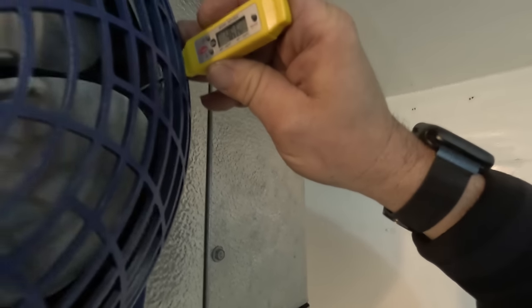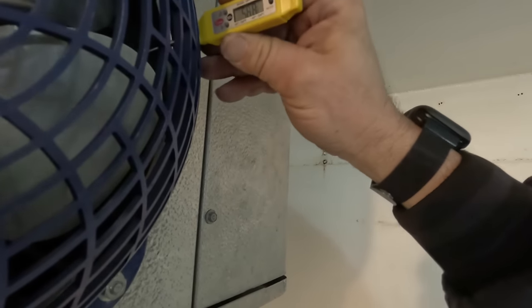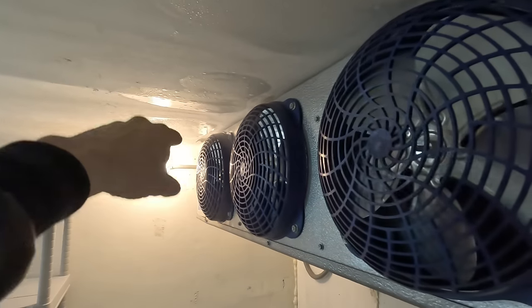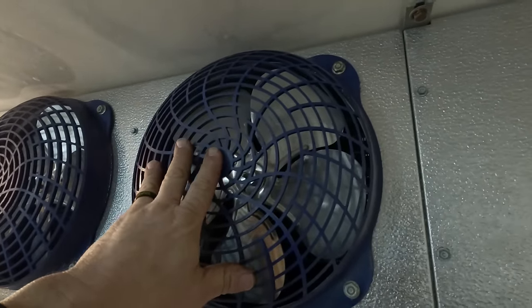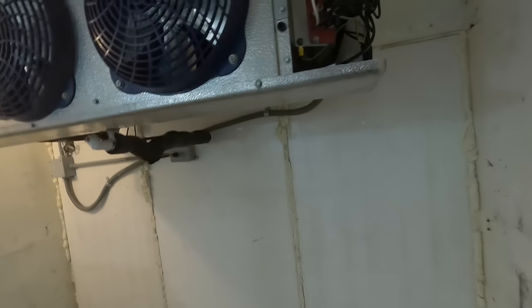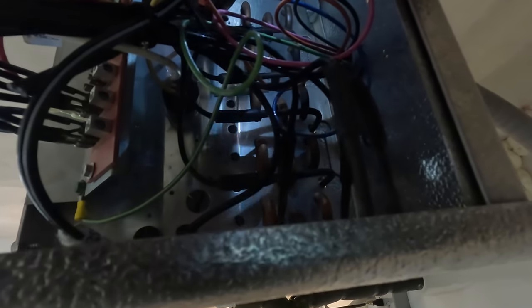If you've got weird issues where people are leaving doors open and you freeze up too often, these are good things to know so you can use it later to figure out how to deal with that situation. Right there at that height where that switch is, we're at 46, almost 47. If I tilt it up a little bit, instantly jumps to 54. So she's going to trigger here real quick — eight minutes and 59 seconds. You can see how the heat is coming out. It just clicked out at 13 minutes. So it's doing its job.